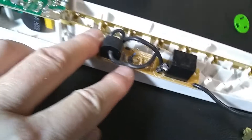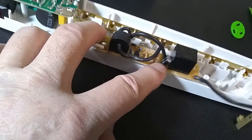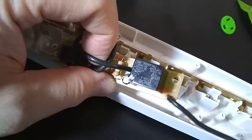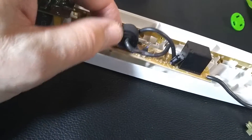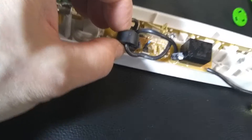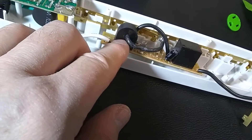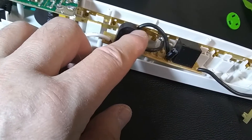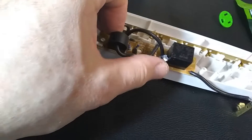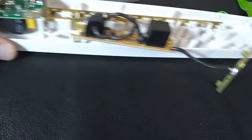The single active electronic component is an SCR in a TO-92 case. Other than that, there is one diode, six resistors, one capacitor, a 48-volt DC relay, and a little current transformer. These transformers are usually 1-to-1000 or 1-to-2000 ratio — I assume this one is 1-to-1000. The primary winding is just the wire that sticks through it with 1000 turns inside, and this will trigger the thyristor — the SCR — which will turn on and off the relay.